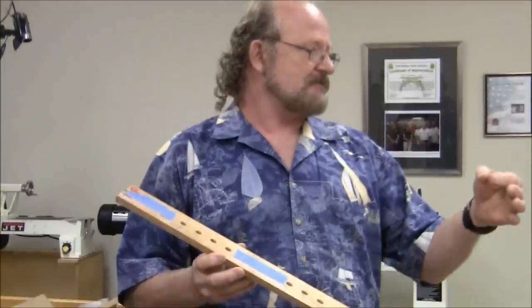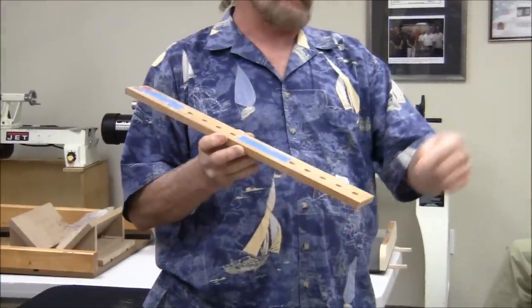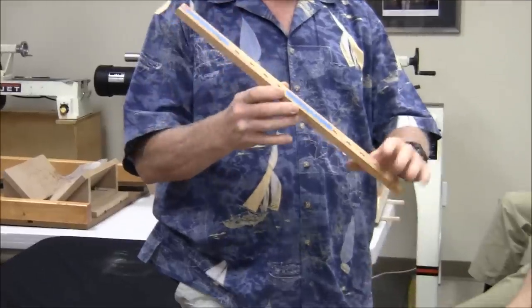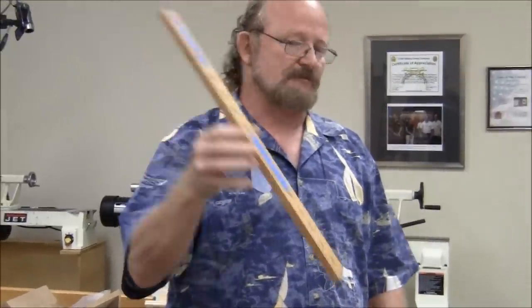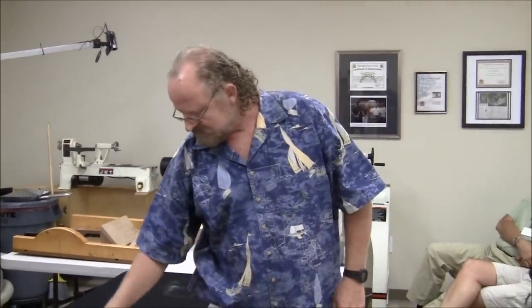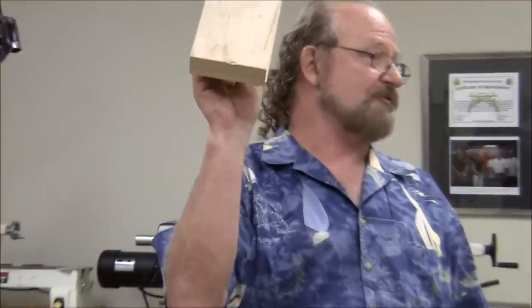So it's probably a 5/8 bushing on the router. It drops in these holes. You plunge the router. You've got your shelf hole, and you can make these any sizes you want. This is for like a base cabinet, and for large bookcases, I have larger ones. And a little jig that has really served its purpose for many years.